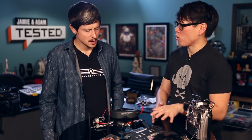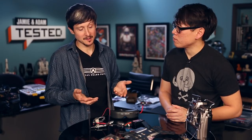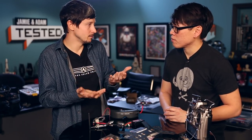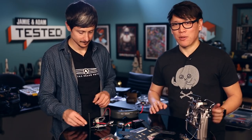Let's talk about weight — how do you know when you've hit the weight limit of your motors? My personal opinion is just fly it and you will feel it. If you're punching it and it's not going up fast enough, you're probably putting too many things on there. You don't want to obsess over it, but you definitely have to consider weight. This setup can run without a problem and will have plenty of power. But if you start adding a bigger battery, a GoPro, and more — you might need bigger motors or a bigger battery. You just have to balance it. All the components we're using are listed in the description — let's start building.